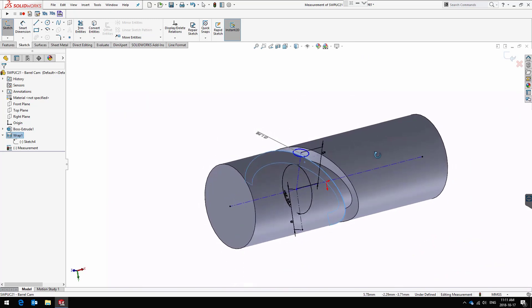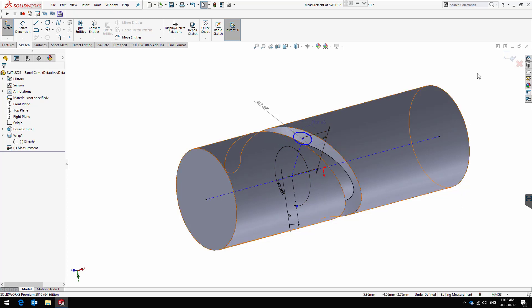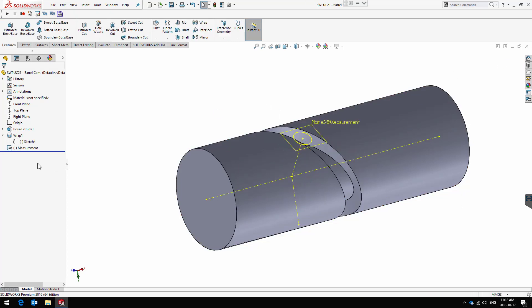And that's all I have. Whenever I need to change something, I'm taking advantage of Instant 2D and Instant 3D for probing. If I want to check what's happening on the angle, I would simply select the angle and drag this point. You can see how the angle changes, and the driven dimension determining the diameter of the circle updates automatically. I can do the same by modifying this 5mm dimension. If you just select the sketch and you have Instant 3D, all these tools are available for probing.